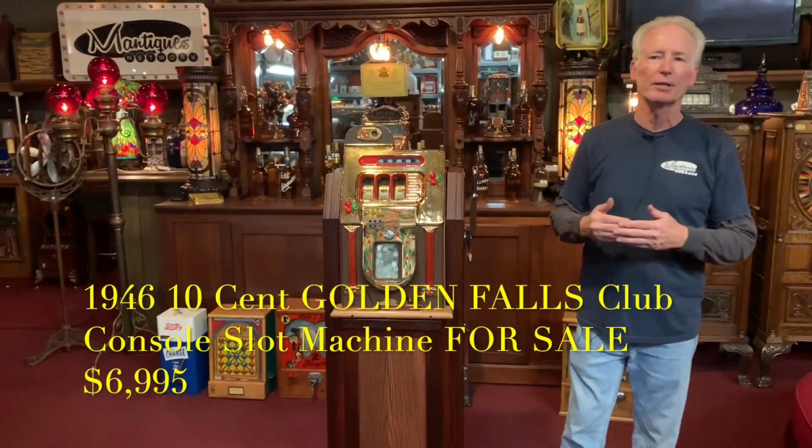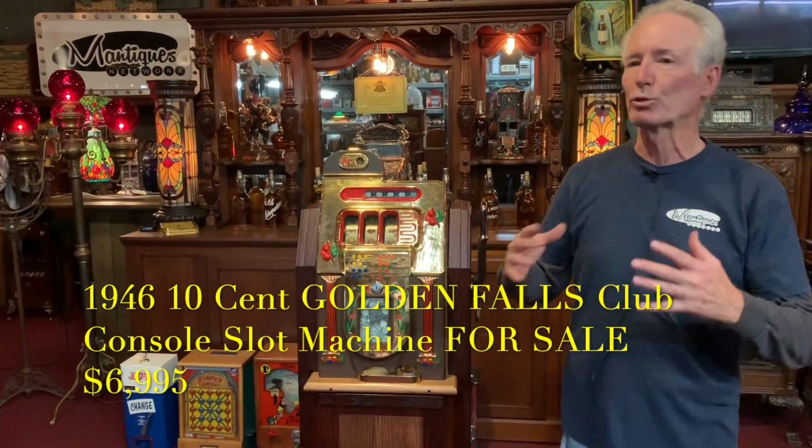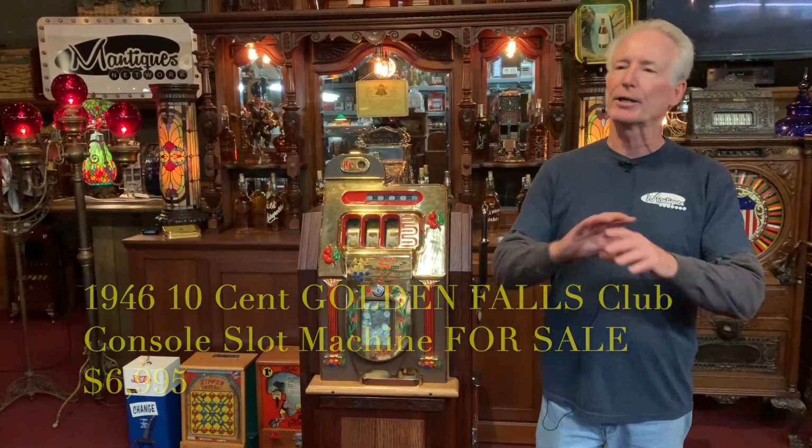I got the machine in, I took it all apart, I completely resurfaced it. I got all of the old grease and everything out of the machine and completely re-lubricated it and serviced it very nicely. The myth is don't buy dime machines, but in my years, a good running dime machine runs as good as any machine. The problem is actually the coin, because a dime is the most likely coin to be bent. Don't put any bent dimes in it, you'll be just fine.